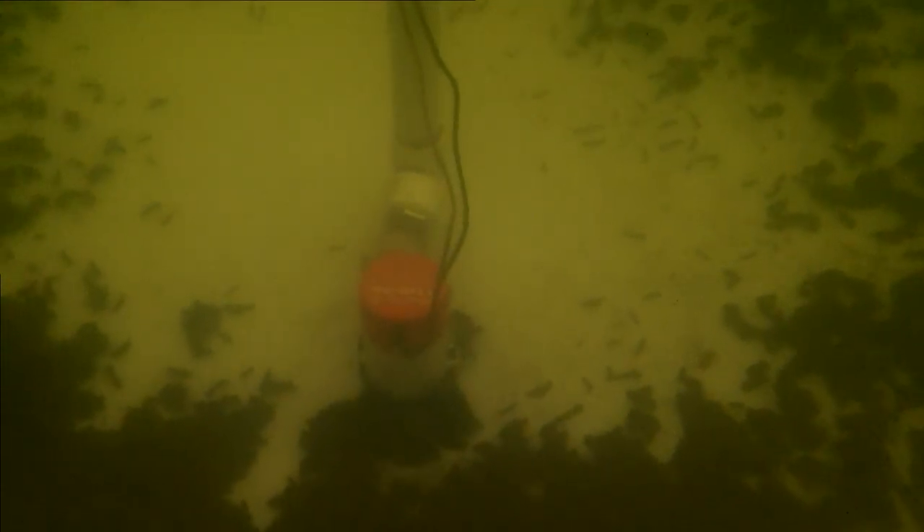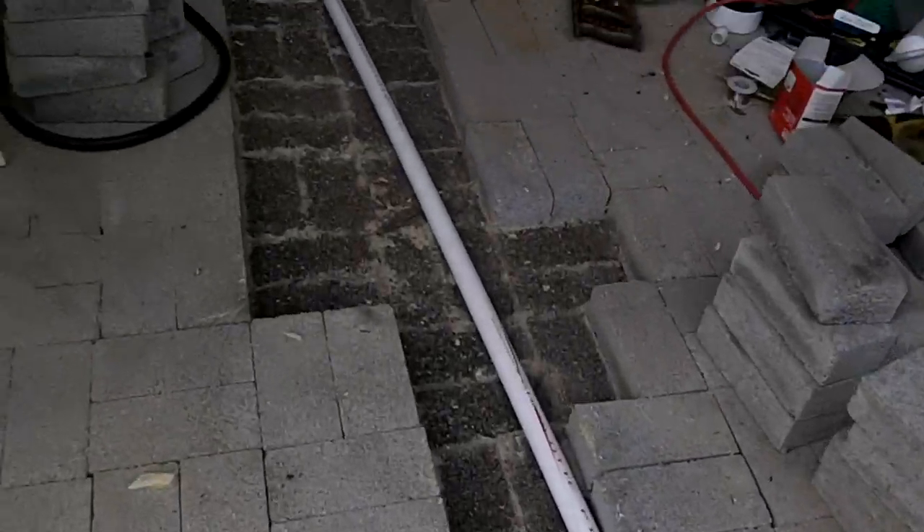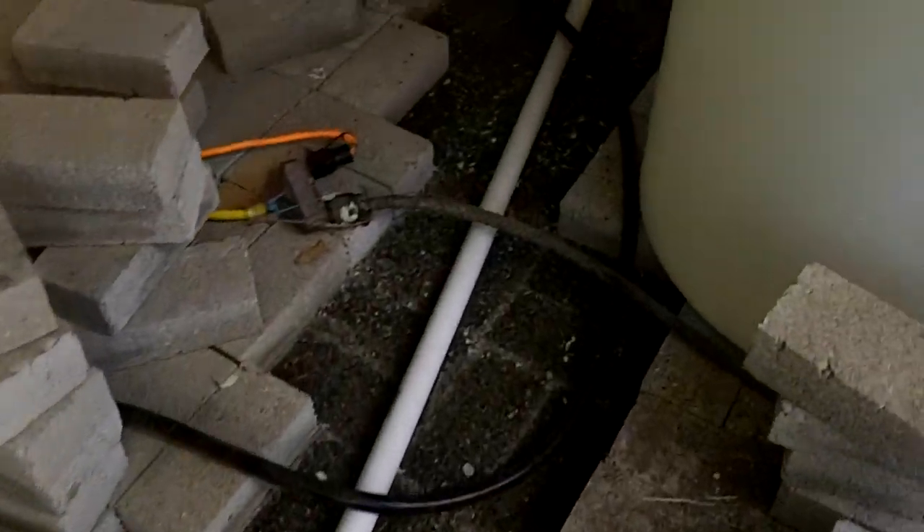This is the view inside the buffer tank showing how the water pours into it to help create a swirl flow. The bilge pump sits at the bottom of the cone shape sucking up any solids that eventually work their way to the bottom of the cone. The supply lines from the buffer tank and the grow beds are 1 inch PVC lines rated for potable water.